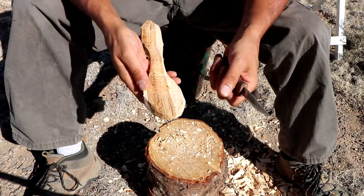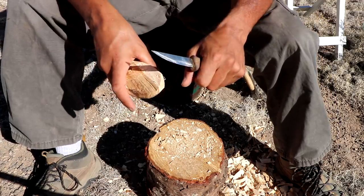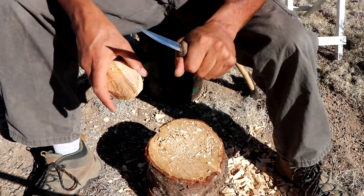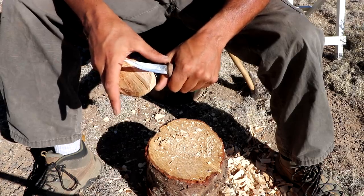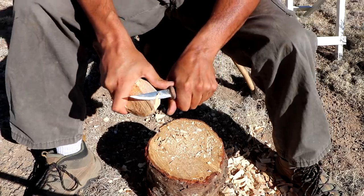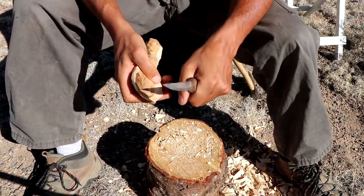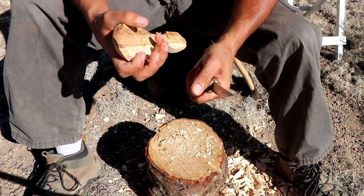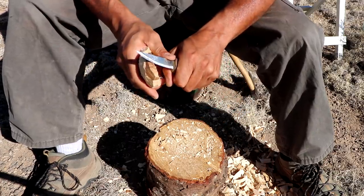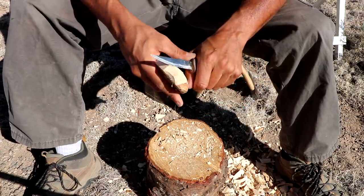One of the most common and most useful cuts I use is called the push cut. I'm left-handed, so I grip the knife with my left hand — a nice tight grip — and then use my opposing hand to either push on the blade or push on the wood. That's the name: push cut. It gives you a lot of control, and you're always cutting in a direction where your hand is not resting. I make sure my hand is holding the wood and I'm doing the push cut away from those fingers.